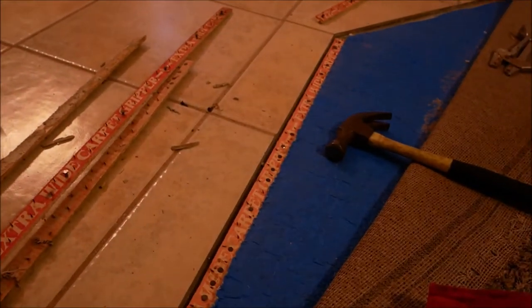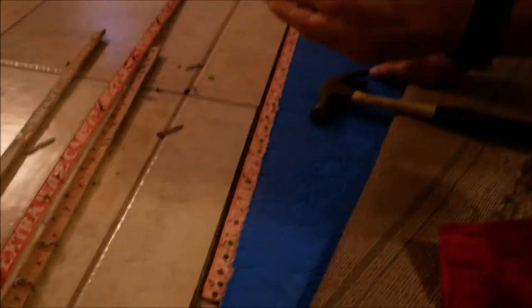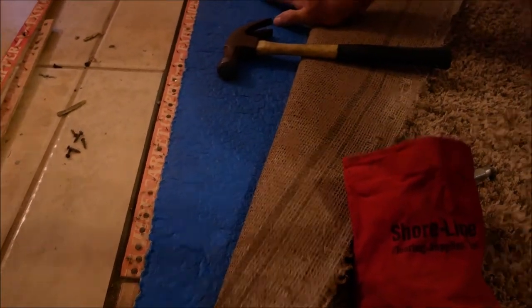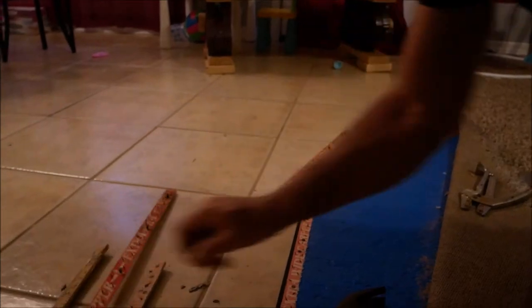When you're having problems with concrete going in, sometimes a longer nail will work. I'm using stubbies. Stubbies are great. This is the type of nail that comes out of the most tack strip has these, so I'm going to try this longer. I'm pretty sure that these are 3/8 and these are 1/2 inch. The one I'm using here is a 1/2.